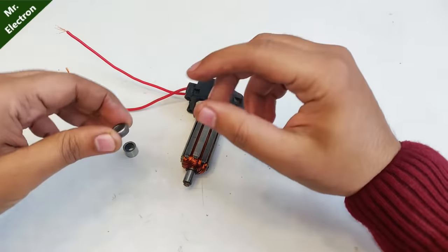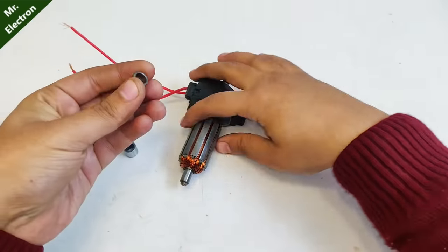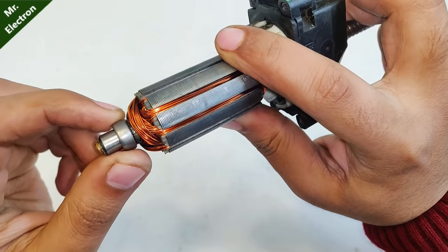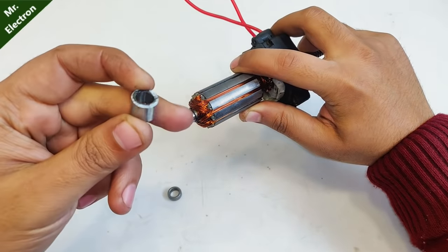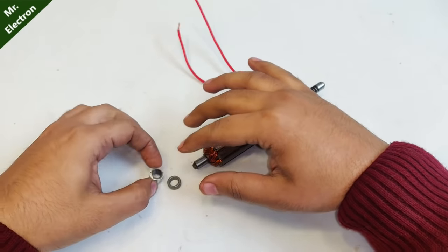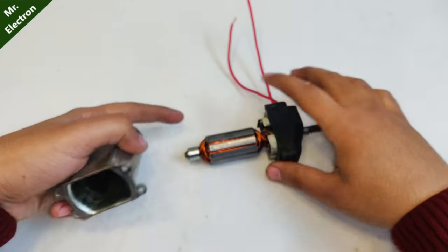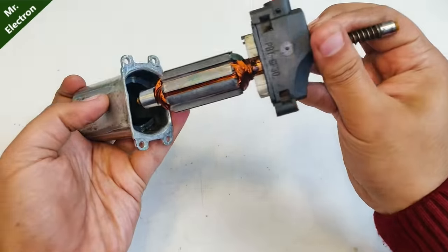So guys, the motor was not working properly. You see this piece, this was connected here to the shaft at the back, and there was another piece but it was missing in the motor from the beginning. So I had to make this other work piece, and this piece is like perfect for this, and all the dimensions are matching 100%. You see that plastic bore, in that I have to place this back of the shaft with that holder. So let's do that.